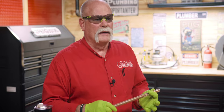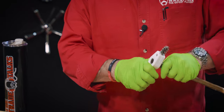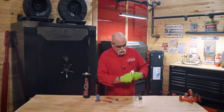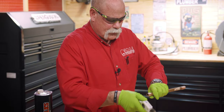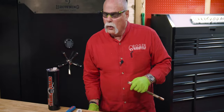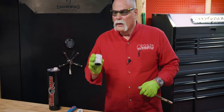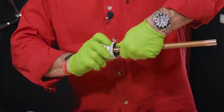If you're going to solder both ends, go ahead and clean both ends. A little modern technology — now instead of using abrasive cloth, they've got brushes that are great. Lots of different ways to use them, and as you can see, it gets it really clean. You can ream it with newer tools as well. This is going to make sure you don't have any problems in the future.